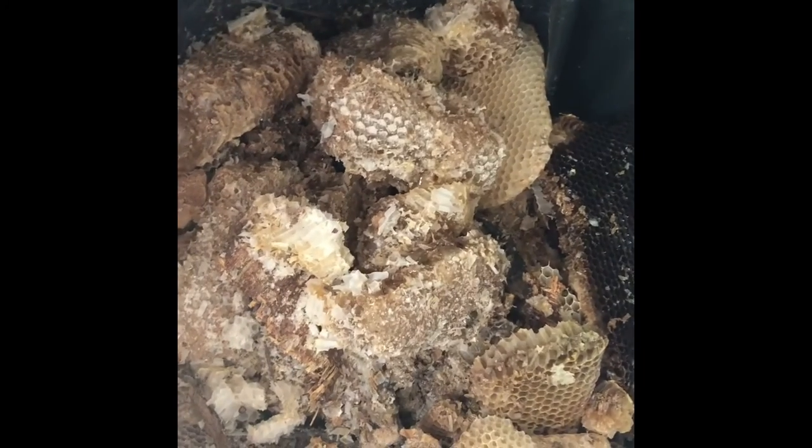The hive is out and we've put the insulation in place. This is the bee prevention you need when you use ASAP for the hive removal. Bees cannot nest in a location that is already occupied — and that's what the insulation does. Before you put the floor back down, we make sure that entire space is filled with fiberglass insulation.